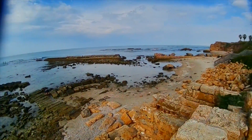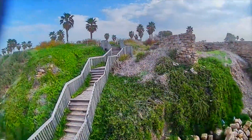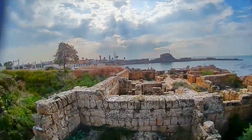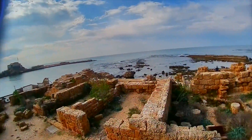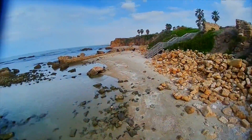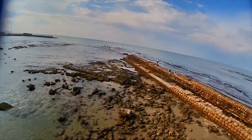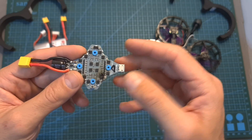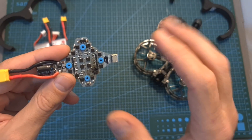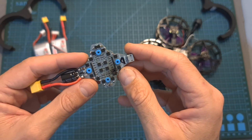The next thing I did was head outdoors and test the Micron. However, because I don't have many compatible 3S batteries, I asked Home FPV if it's okay to use 4S batteries and just limit the motor output — they told me I could try. Unfortunately, I don't recommend using this quadcopter with 4S batteries. At first it was okay when flying without an action camera and with the Insta360 GO camera, but the moment I tried it with the GoPro, the ESC burnt. So I recommend sticking to 3S batteries to stay on the safe side.